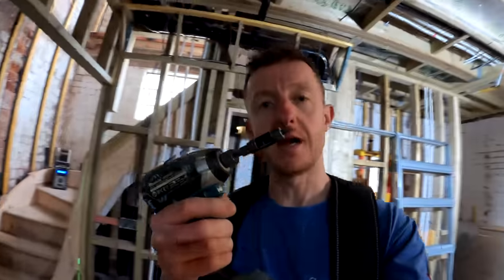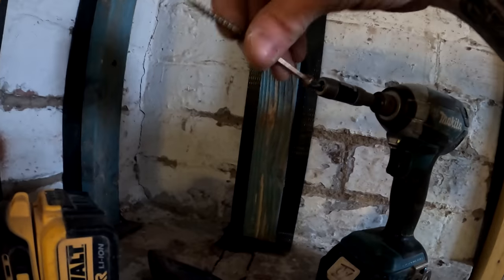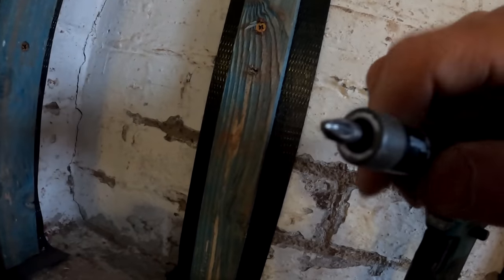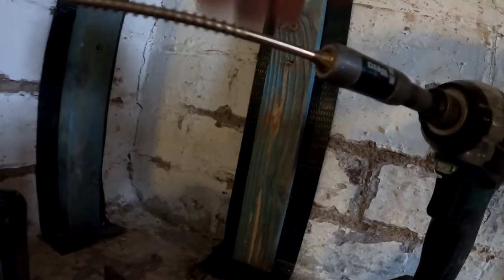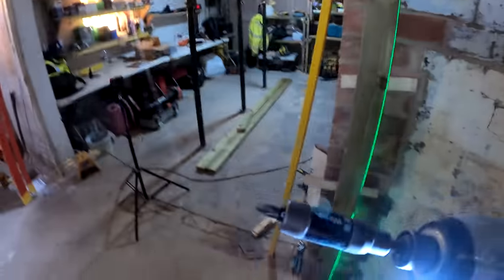One thing I didn't mention earlier about my impactor bit - quite an important and awesome thing. Obviously when you're boarding ceilings or you're doing stud work like this and you've got to work overhead, it's always a bit of a nightmare relying on the magnetic bit to actually hold the screw for you, because it has a tendency just to drop. Whereas this one has got a nice little feature where you just pull this out like that, and then it's very magnetic on the end - it holds the screw like that. Just as a demonstration as to how strong it is, it's strong enough that you can have it on your pouch with the screw in, and then you can easily just hold it above your head - it just pops out. So you can see then you're in where you need to be, you've just gone far enough so you don't keep driving it in. Definitely worth having one of these in your arsenal, makes it a bit easier, and we all like an easy life.